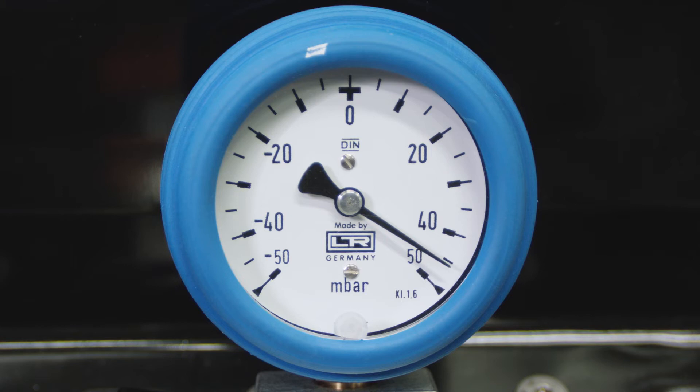Note the value. Wait 600 seconds. The value should not deviate more than one millibar from the one at the starting point of the measurement.